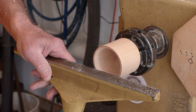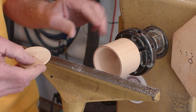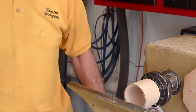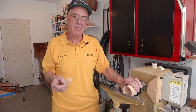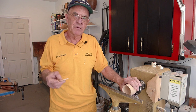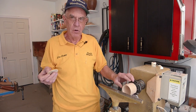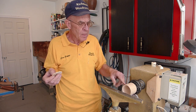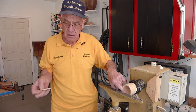So you don't have to sand so much. I did weigh some of these before and after piercing, and I found out that piercing removes about 75% of the wood. So there's not a lot of surface left to concern yourself with for sanding or a great finish, because you're never really going to see it. At this point, you can paint the interior. If you do paint,